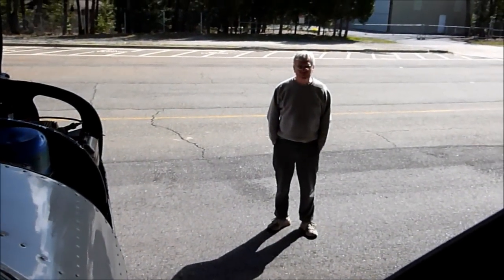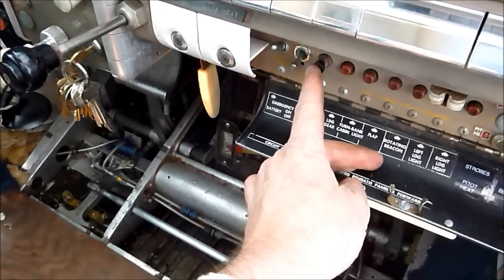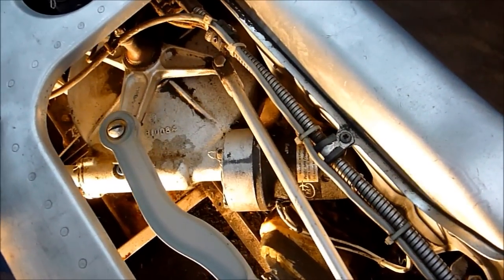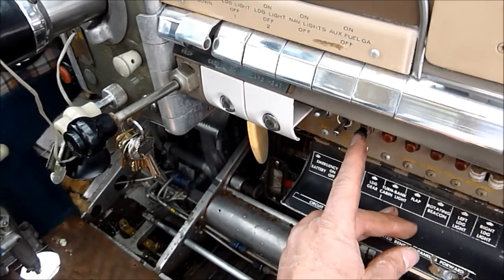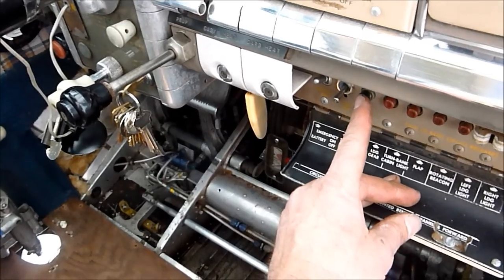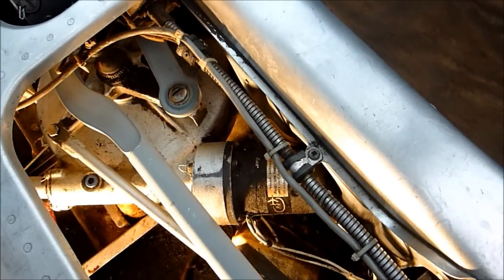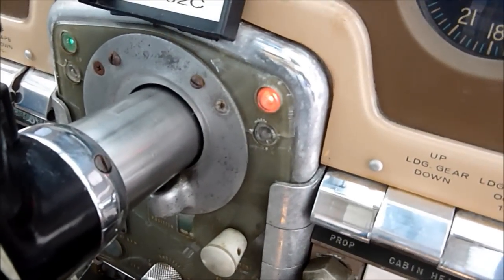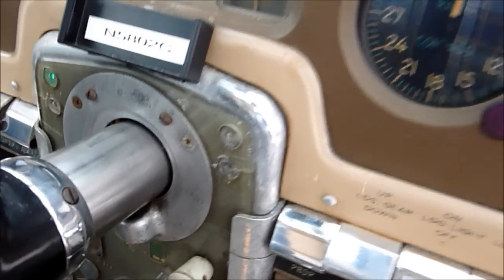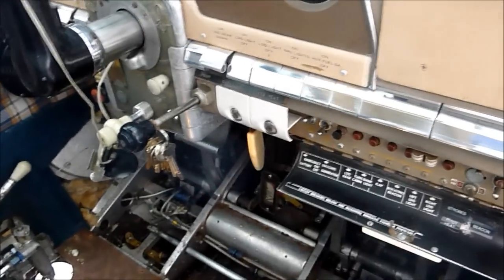Clear down there Bill — the gear doors are clear. Looks good. You can see the mechanism begin to retract the gear, and we'll continue to retract to the fully retracted position. Now, with the circuit breaker pushed in, you should get your red light indication for the gear up. Circuit breaker out — light goes out. You also want to check your gear warning horn for proper actuation and irritating noise level when you do this test.